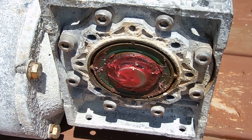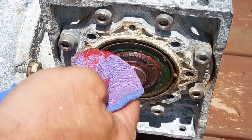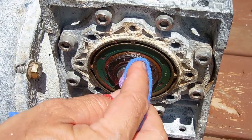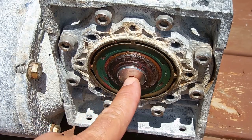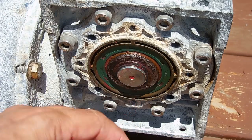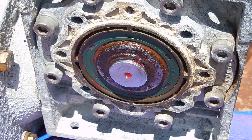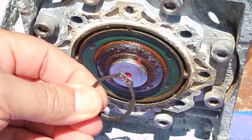Here's what it looks like underneath with the cover removed. Let me wipe off all this debris. There's a bearing right there and grease that I packed about a year ago, which I'll put back at the end. The shaft right here is going to slide through this bearing once the clip has been removed, out the other side. You can take a socket, place it just over the shaft, and tap to push it all the way through. Let me get the tool to remove the clip.